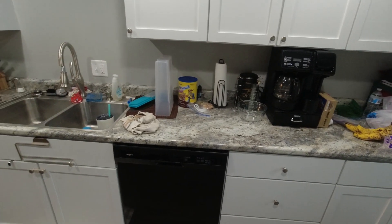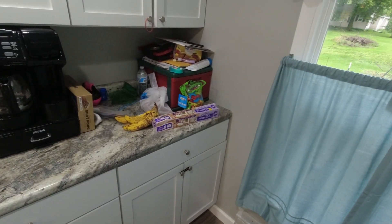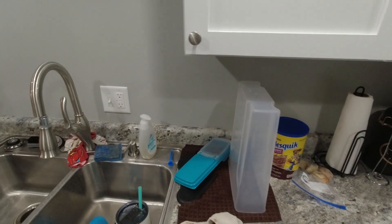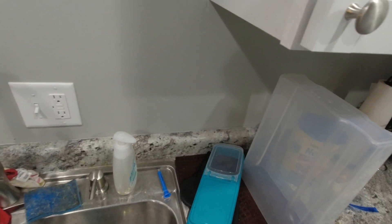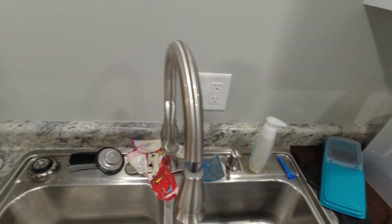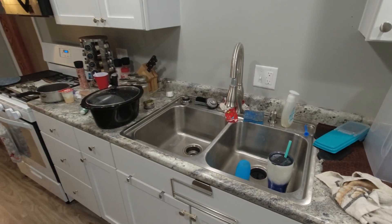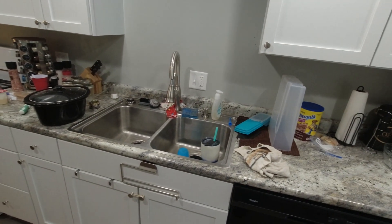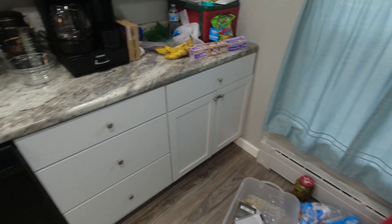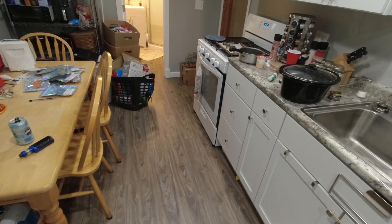As I mentioned, if you've just moved in you know how hard it is to get organized. We have a countertop here, and if you remember from the earlier videos, I made sure that this wall was straight so I wouldn't have to do any scribing on the back. With it being nice and straight I didn't have to mess around — just a little caulk seal. Got the sink, all the knobs on the cabinets, and the dishwasher in. Everything is functional.